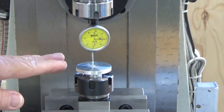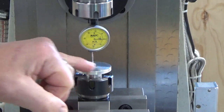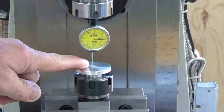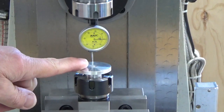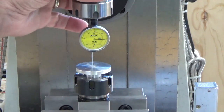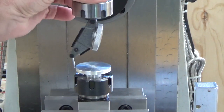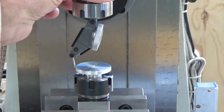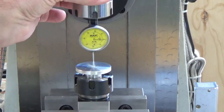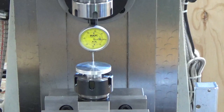What we've done here is set up the X-Y position for zero, which is the center of this disc. Initially we put an 8mm drill bit in just to get a rough center, and once we got that we used the indicator. We went around the edge and checked it on four extremes, kept moving the X-Y position until we got zero all the way around. Now we've got zero — we're pretty much dead center.